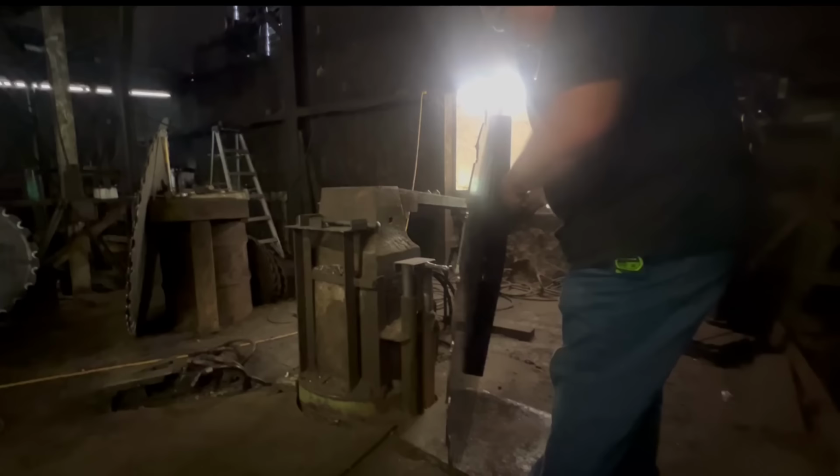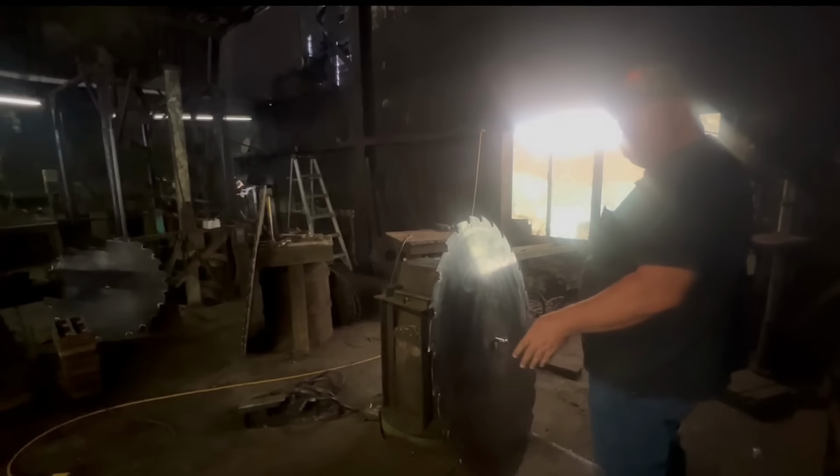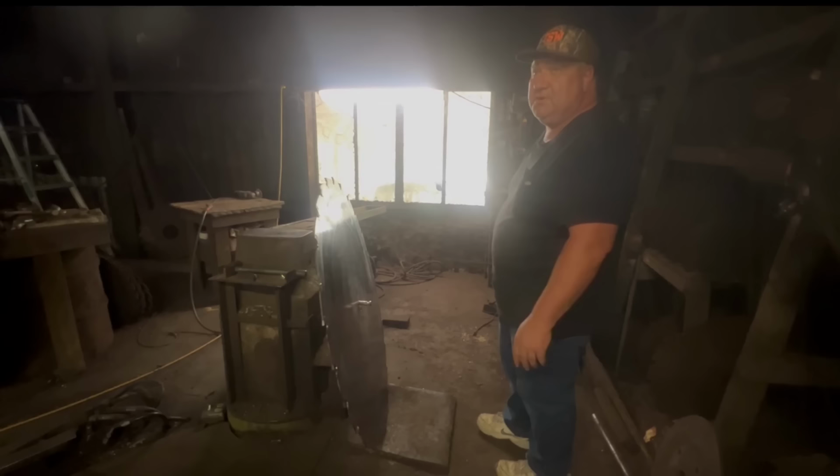See how it's got a little bit of light under the gauge there? But it's even. Going on in, it's going away. That right there, it got turned into the log just a little bit. And actually, when you run a saw and try to get out of the log, that's what you turned into the log just a little. You get a little more light. So that may have been a little of the issue I was having. It was real, real bad. Yeah.